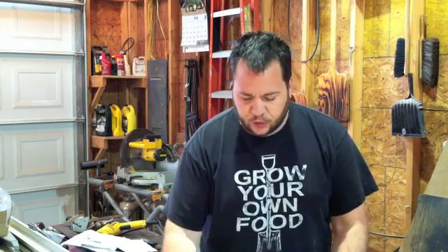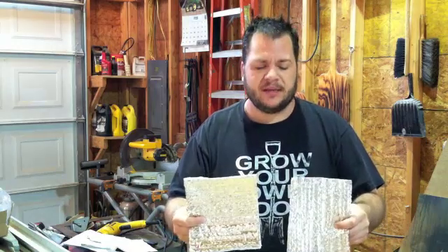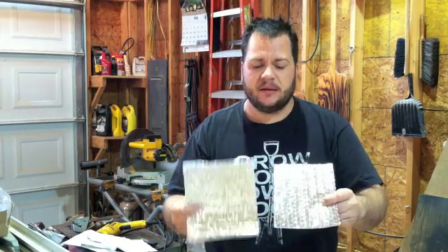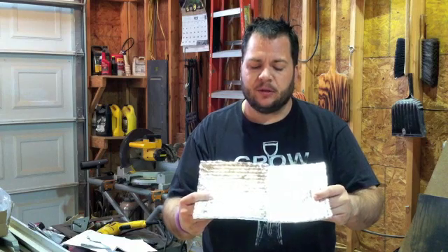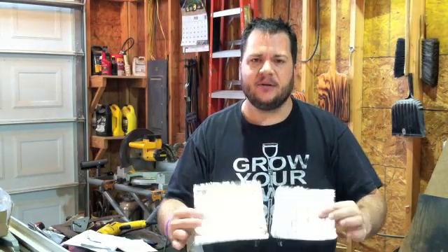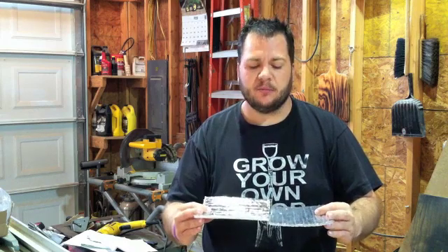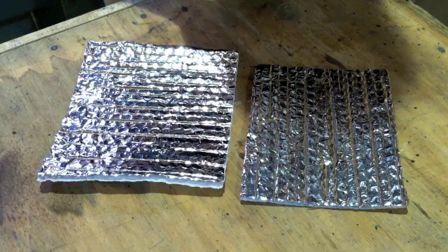That way we could wrap it up the sides, around the back, and around the tongue of the trailer, all underneath our subfloor. We laid one piece down, put a piece of tape underneath it, then took a second piece and joined them together. We put the foil side facing up to keep heat inside our home, and the white weather-resistant side down to reflect moisture and keep it away from our home, while maximizing the insulatory properties of the product.